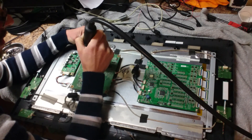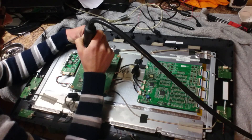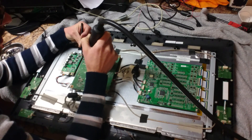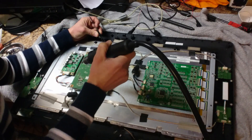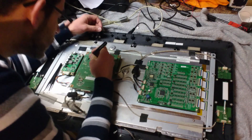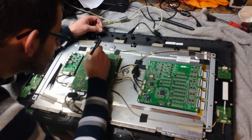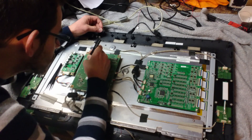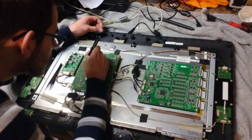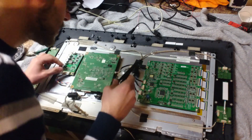I knew on the backlight issue that it was this, but on the totally dead board there's really no solid hint that this chip is dead — there's no way to tell. Because the microcontroller shuts it down, you can't do the same test. Also, they must have used some really crappy flux when they put this together, because it looks like garbage. So I carefully and gently remove some of that residue — I chip it off a little bit in case it's going to cause a connection issue.